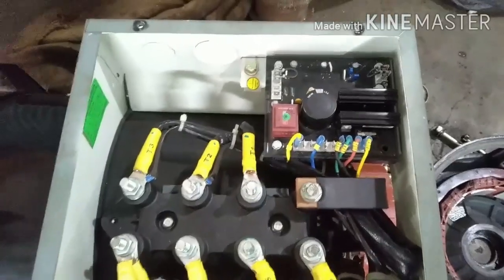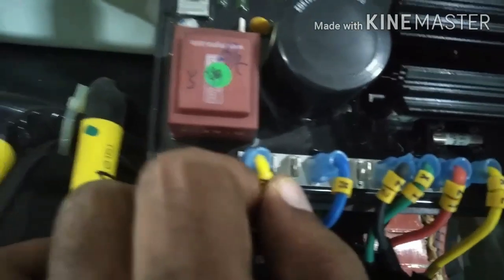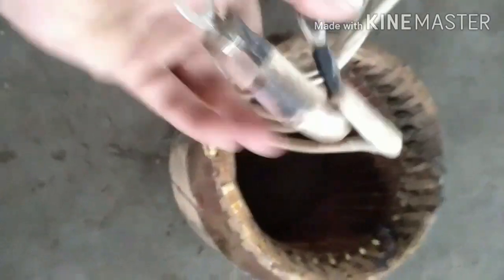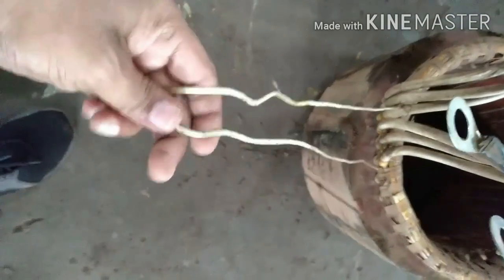In this particular area there will be four wires of your auxiliary: two will be from your phase and two will be from your exciter stator. Now let's take an example of a burned alternator to show the auxiliary wires physically. In this burned alternator you can see there are three wires — your R, Y, B — then the next three will be your neutral cables, and then there are two leftover wires: E1 and E2. This wire coming from the main stator is your auxiliary winding.